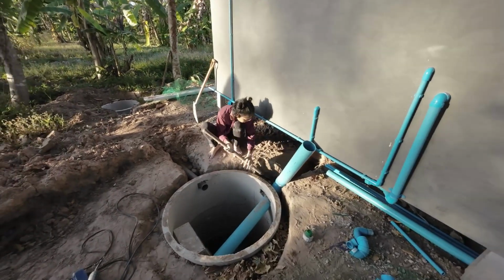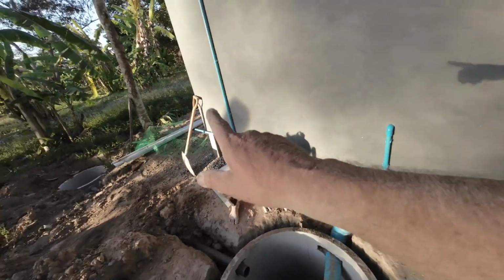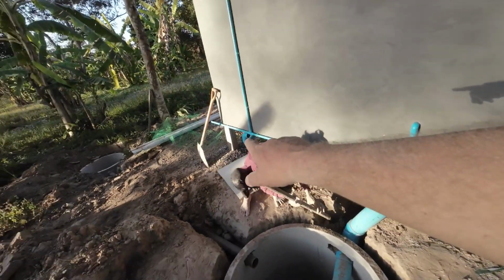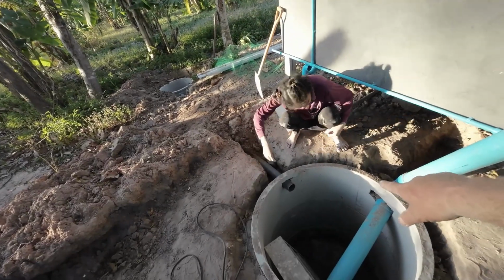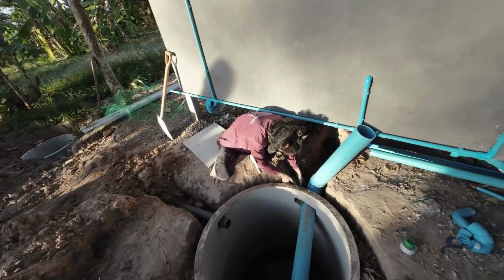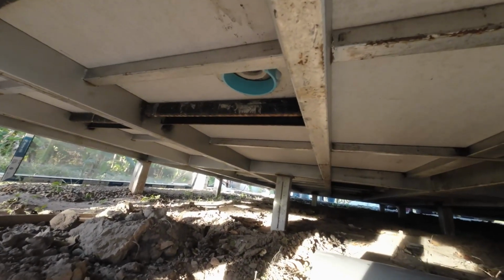Okay, here we are on the back end. We finish off the septic. We've done all the plumbing, the water feed, the waste. It's got to be finished off. We've got the overflow to go down, so there's a mesh trap to put in here first before we put the cover on. So we just got this bit to connect into. See it there.